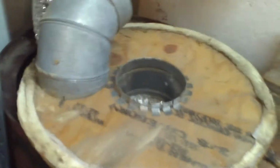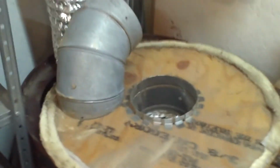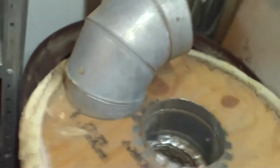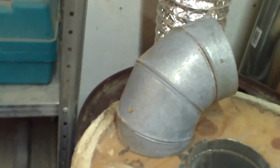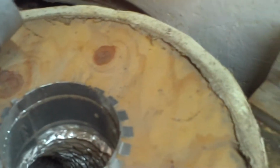You've got a grommet in the middle that your vacuum side goes on, the side going to the blower assembly, a vacuum assembly. And then on the inlet, I've got an elbow here, and the elbow is set up to do the swirl. It just runs around the rim of the drum and causes a circular motion as it goes down, and that keeps all the particulates flung out to the edge, and the lighter air will come up through the center as it exits and steadies out.